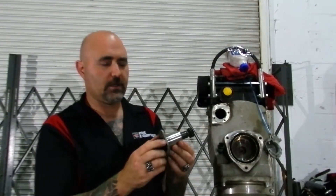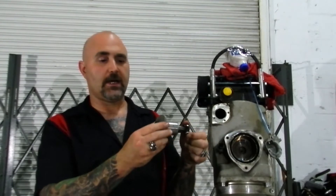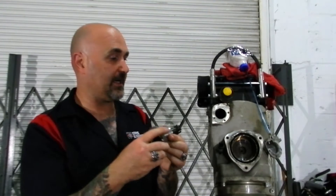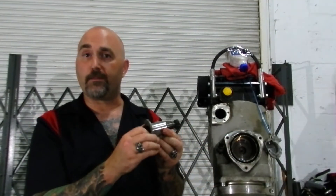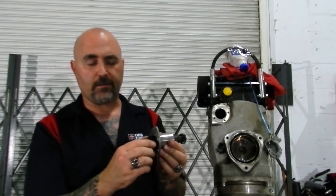This is the cartridge. This is what connects the gear that operates off the clutch drum and operates this little worm gear, and it's the worm gear that drives the oil pump. Again, if your clutch is not engaged and the machine is not jumping, you're not pumping oil.